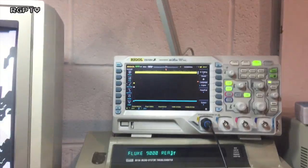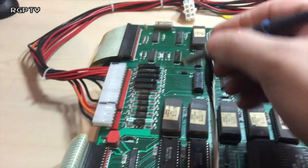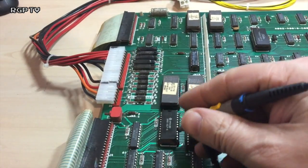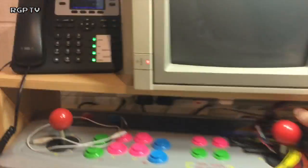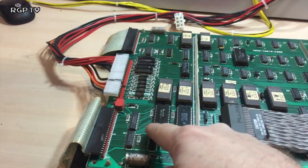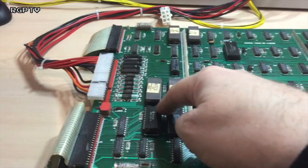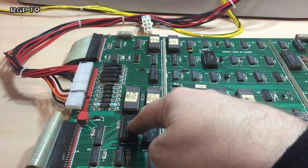it stops. So I've pressed the stop on the Fluke. So it's either that there's no connection between there and there, which is the common cause on these boards, I have to trace it, or that's stuck. So what I'm going to do, just as a sanity check, is turn the board off and flip that RAM out of there, because I've checked all the address lines and data lines, they're all moving correctly. Take the chip out, and then have a look and see if CS RAM or pin 18 on here changes. If this chip's fused, it will be pulling it low.